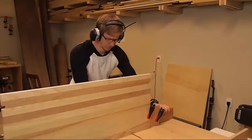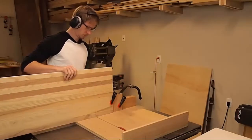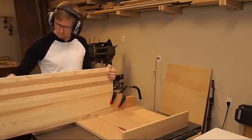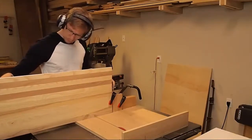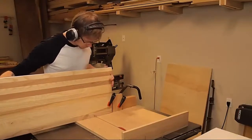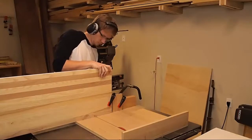So I've already glued up all the boards to make the top and the shelves. They are planed and smooth. This step is putting the four notches I need in the two shelves to accept the legs. I cut to the outer lines of my notches on the table saw, cut out the waste with a fret saw, and finish cleaning up with a chisel.